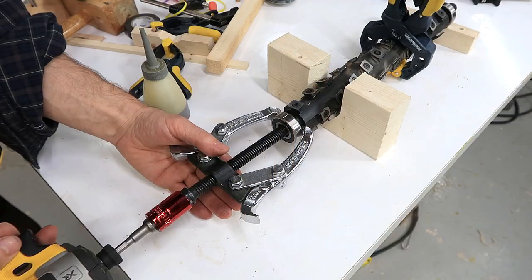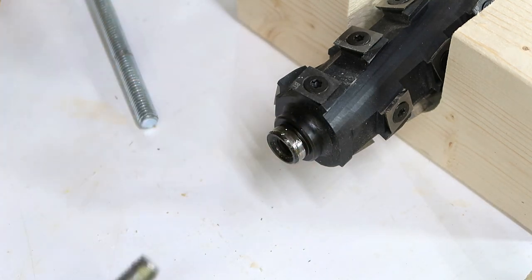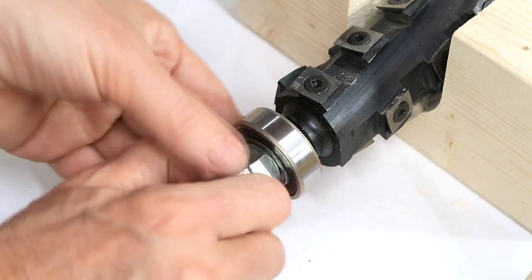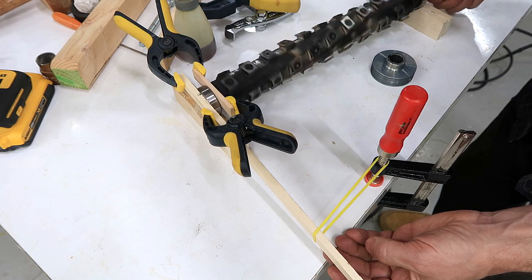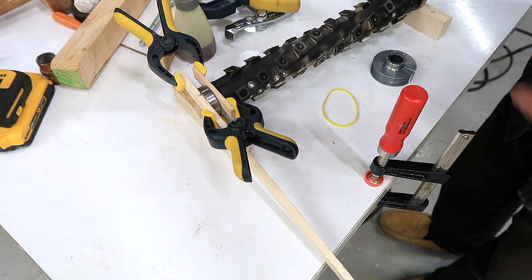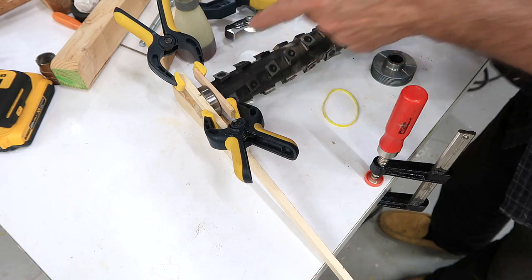I think I'll try pulling that one off too. I've got an M8 thread in the end of this thing that used to attach a little gear - I'll try to use that to squeeze that bearing back on. With tension on it, I can't say that this wobble is any less than it was before. But if I take the tension off, it doesn't move at all, because the amount of slop in the bearing is more than the amount of wiggle. So as long as that bearing is where it likes to be, the wobble is within the slop - I'll be okay.